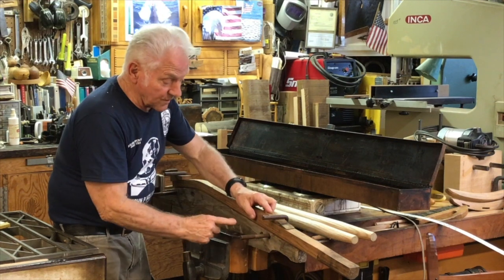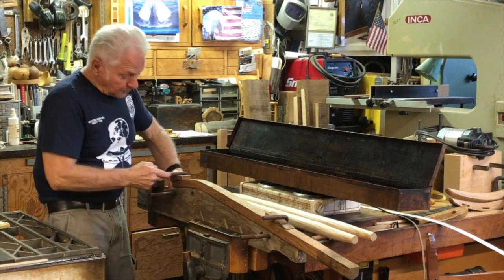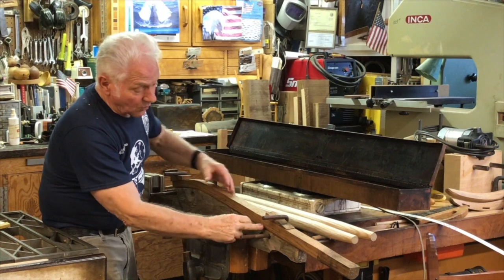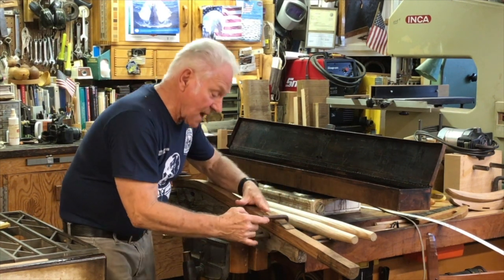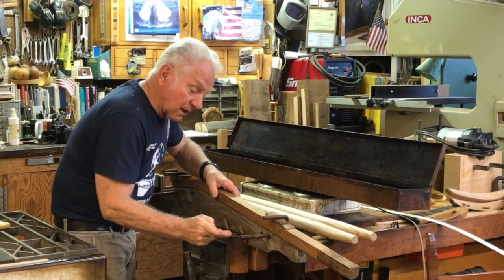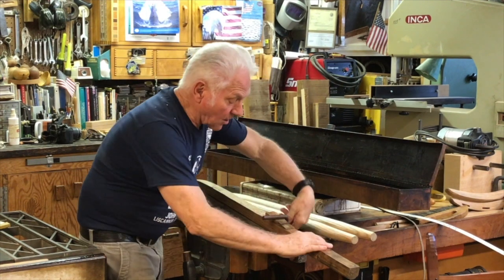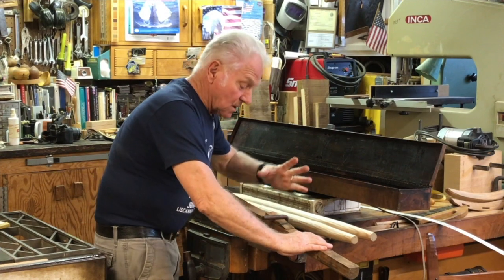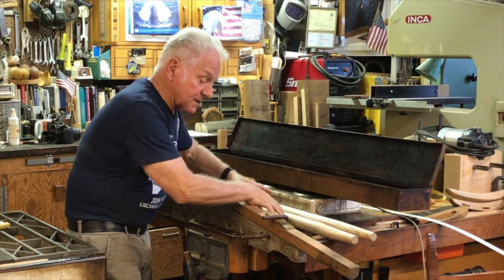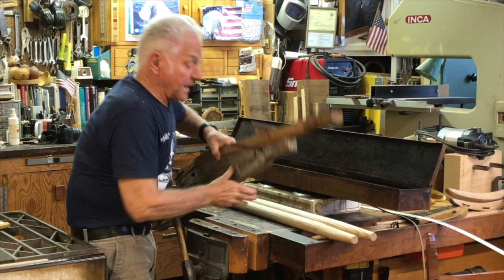And the U-bolts with the wedge is really a simple way. It doesn't tie up any of my shop clamps. I put that U-bolt and wedge right here at the very top and then start bending it down, bring it down against the form, slip this U-bolt through a hole, drive a wedge in under here, and by cutting the threads off of this side, even when I slide the U-bolt back out of the way, it stays right here in the form. As I'm bending this down, all I have to do is flip it up, slide it in place, and I'm not fumbling around reaching and trying to find the U-bolt. And then I have a whole bucket of wedges, and I just drive a wedge in there. Really is a nice, simple way of bending chair legs.